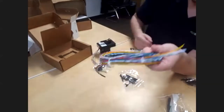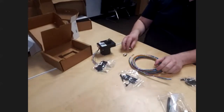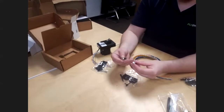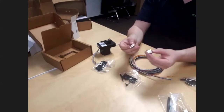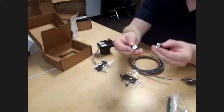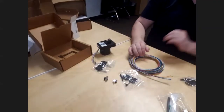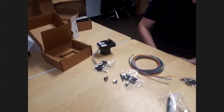Yeah, and there's a bit of clever engineering in there. Whenever you press the disconnect switch, it does send kind of a digital signal to SkyView that says, hey, turn off the autopilot. But whenever the disconnect switch is depressed, meaning if you're holding it down, the servo itself is electrically unable to drive. So there's kind of redundancy there in the disconnect switch, which is really nice.